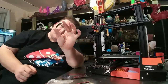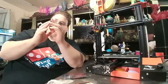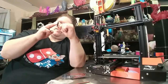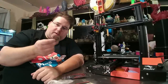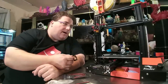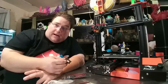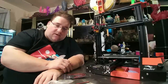Here's your dampers. Basically this is actually three pieces: two metal plates — one plate attaches to the printer, one plate attaches to the stepper motor. But these two metal plates don't touch each other. They are connected by an overmold of rubber in between them. So that isolates the high frequency vibrations from your stepper motor from your printer. The noise reduction is spectacular — it's truly mind-blowing. I have enough of these to do like 20 printers. You only need two: one for the X and one for the Y. The other two don't move fast enough to really need it.